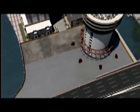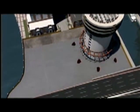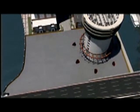We're going to install the first level, which includes the lobby of the building, the sort of tension ring that supports the massive seven columns that come down. We also have to build the substructure that holds up the fountains and the planted areas — it's going to be a beautiful landscaped and paved plaza with lots of trees. And all that substructure is the first thing that goes in, which is unusual.